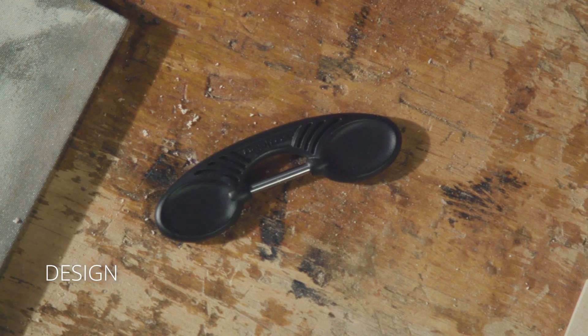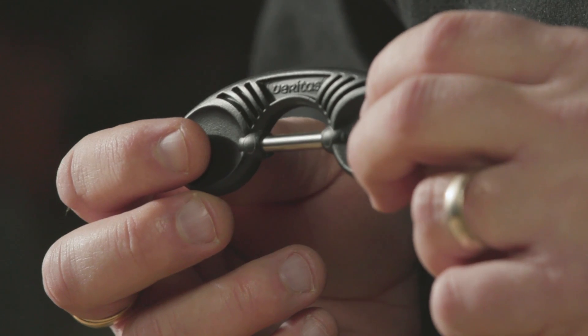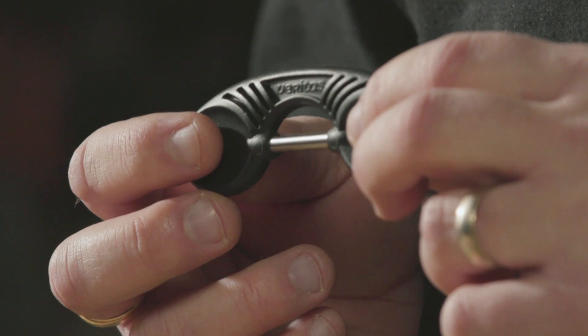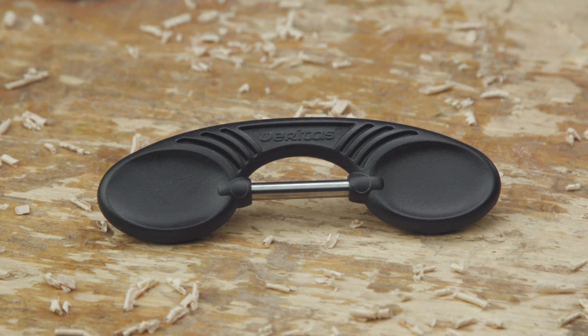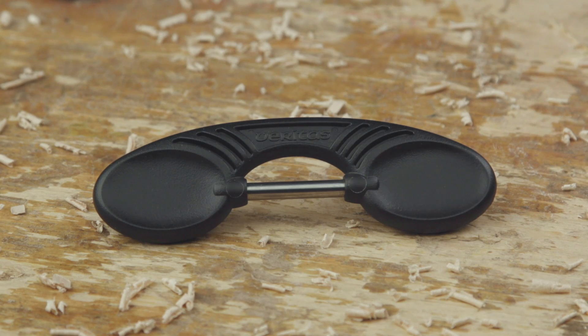So I started off with the idea that we should have just a precision grip rather than a power grip on the tool. Typically, these burnishing tools have a fairly large handle, so you're getting a good hard grip on it, which is counterintuitive to what you really want — having a precise feel for what you're doing to the edge of the metal. The new design has a much smaller bar and a much smaller piece of carbide in it, so it doesn't have as much force. You're not able to apply too much force on it.